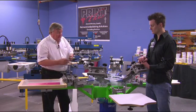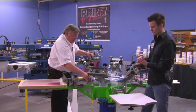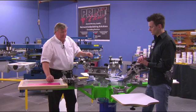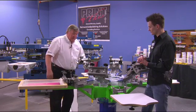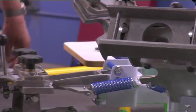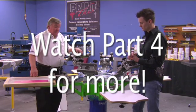What are some other maintenance things, like spring replacement and lubrication? Springs are sort of relative. In the 35 years that I've been using these springs, I've never had a spring company give me a warranty on them. It's kind of a crapshoot — some people have to replace springs about every 10 years. To do that, it's pretty simple: put the arm in the down position, take this top stop bolt out, lift the arm straight up, and it'll relax the back end of the springs so you can replace them. You shouldn't have to be replacing springs on a regular basis at all. This also has a spring protector on it, so we're not talking about a whole bunch of shrapnel.